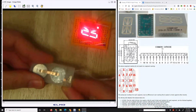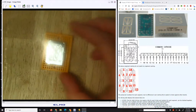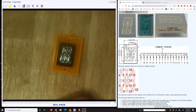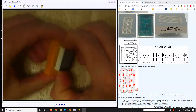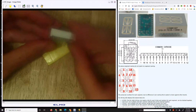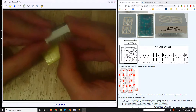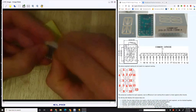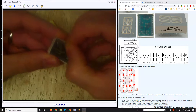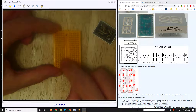Now let's go to the actual display. We'll start with a new one — you can take off the film if you'd like to reduce glare. When you stick in your 16-segment display, be careful not to bend any of the pins as you insert it. Make sure they're all straight coming out. If one does get bent, you can just pull it out and bend it back.